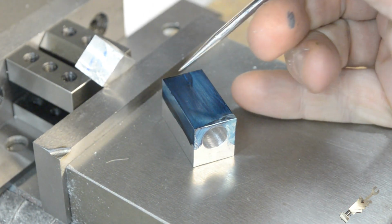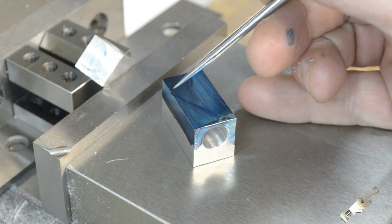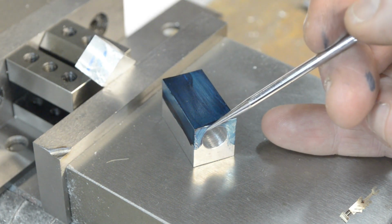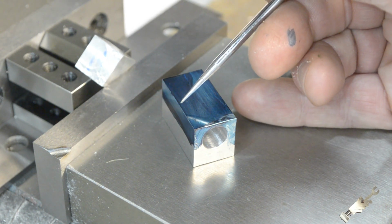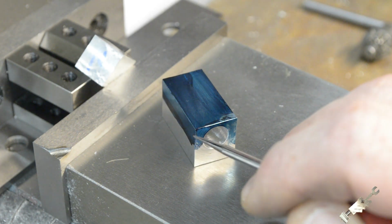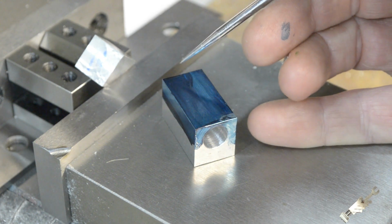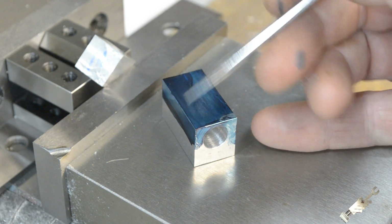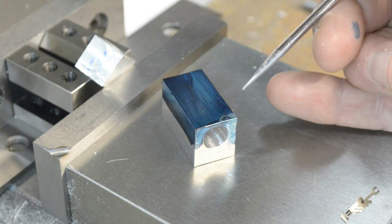I'm going to put a chamfer on the edge of the cylinder block. Two sides, or two corners actually. So there's no dimensions given for any of that. So I'm just going to come up 1/8 of an inch on this face, 1/8 of an inch on this face, and break that edge. That'll leave it with a 45-degree angle there, and do it on each corner here.